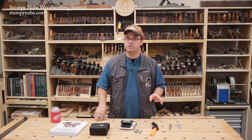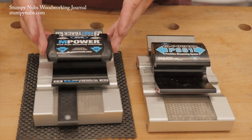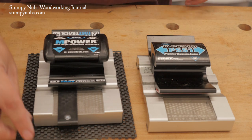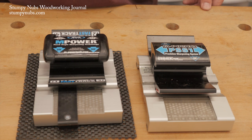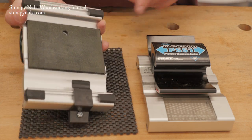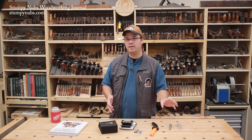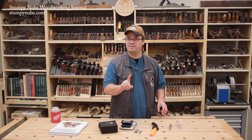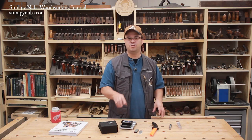The bevel angles are fixed, but that doesn't mean you're stuck with a single angle. By rotating the carriage and changing the clever wedge-shaped diamond plates you can quickly achieve a variety of bevel angles. There are five different grits available, a lapping plate to automatically remove the burr on the back, and a stropping leather on the underside. If you don't sharpen enough to maintain freehand skills, this may be the next best thing. Compared to the MK1, the MK2 has a redesigned carriage for comfort, simplified angle changing, an added centering clip for narrow chisels, a leather strop on the back, and a carrying case. Most features can be retrofitted to the older MK1 system — a classy move for a company to make for their previous customers. I'll link to the MK2 and accessories below.